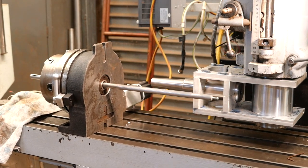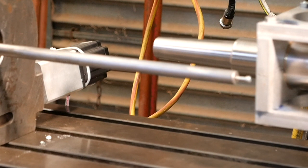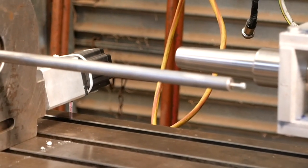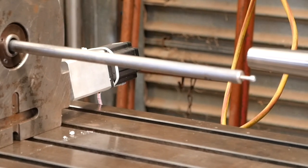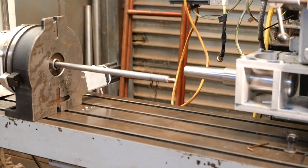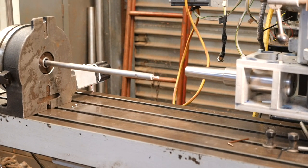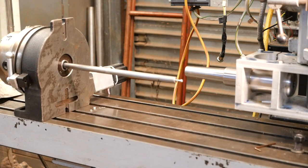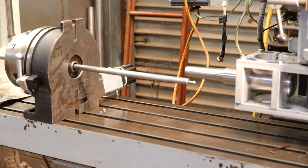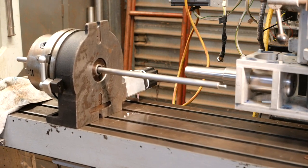You can see the table is moving to the left. I'm not sure if you'll be able to see it on this video but that rotary table is also moving and it's going to do a 180-degree twist. And then at the end of each cut I will just reverse the process, releasing this screw here which will allow the cutter to retract back into the non-cutting position.